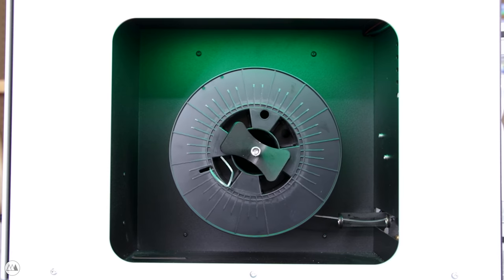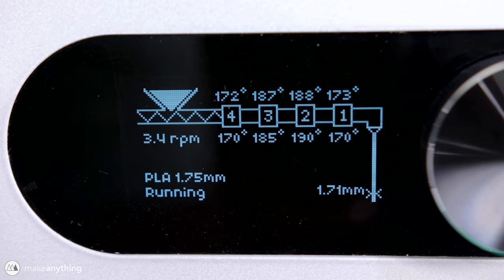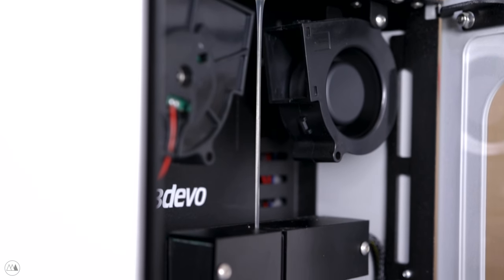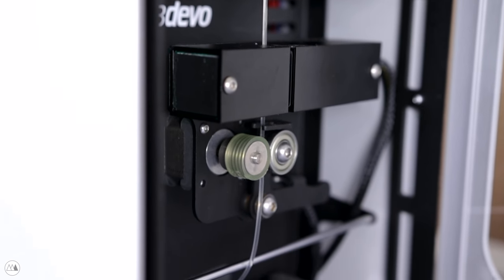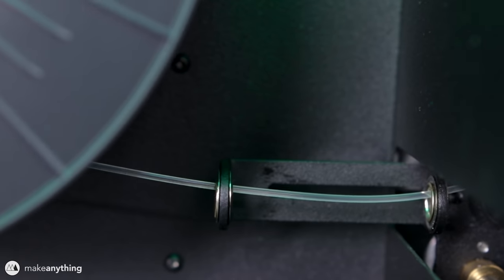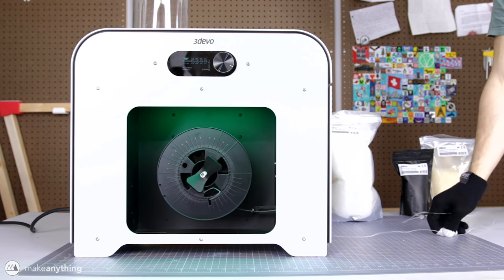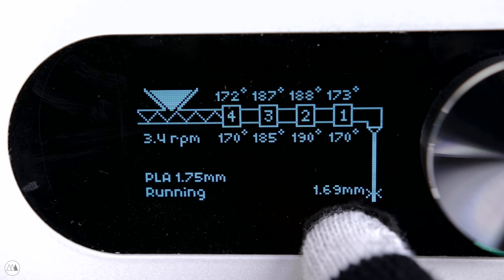Apparently it'll do a kilogram in about an hour or an hour and a half. Overall, the way this thing works is: filament goes into the hopper, feeds through a screw, slowly heats up and mixes until it comes out of the nozzle, cooled by two cooling fans. It passes through the optical sensor, gets pulled down and fed through the positioner, which moves left and right based on the width of the spool to correctly wind it up - all in this single machine. On screen I can constantly see the optical sensor reading, and I'm getting an accuracy of plus or minus 0.05 to 0.07 millimeters.